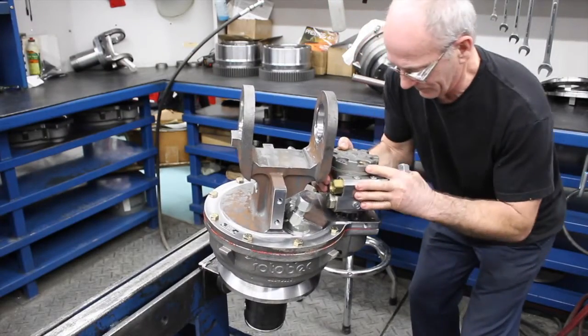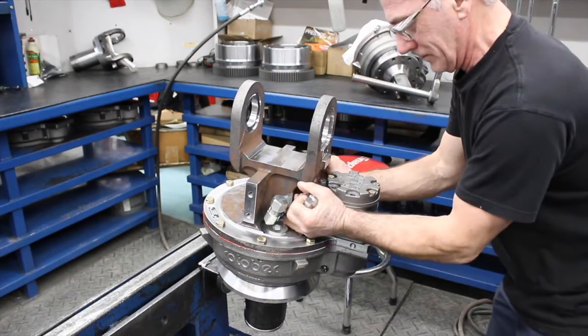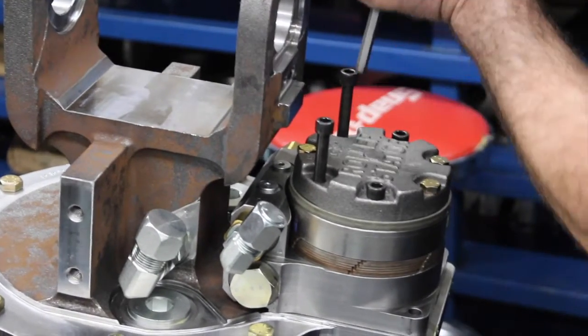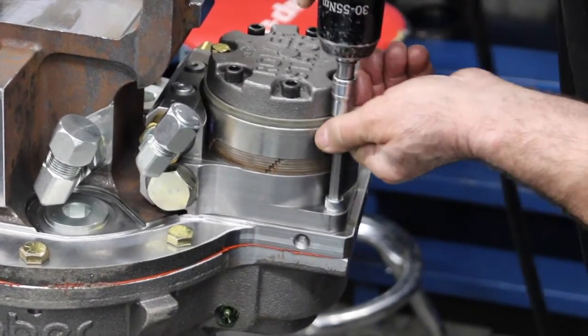Follow this by placing the motor back onto the rotation again at about 90 to 180 degrees offset, then turn the rotate motor back into its final position. Re-insert your six socket head cap screws with Loctite 242 or Blue Loctite. Tighten, then torque to 40 foot-pounds, starting with the four on top of the motor followed by the two additional screws on the flange.